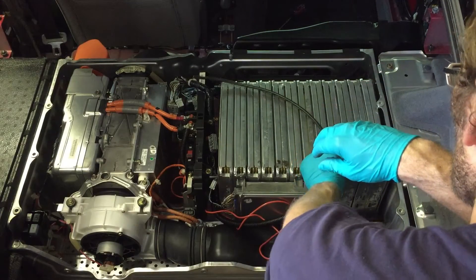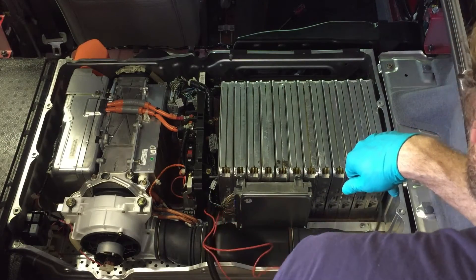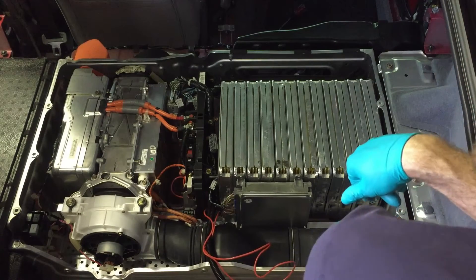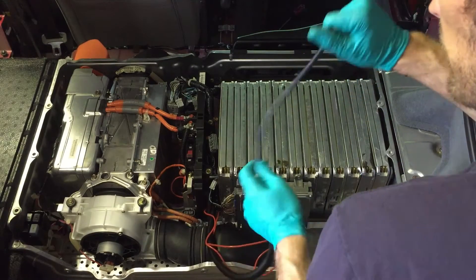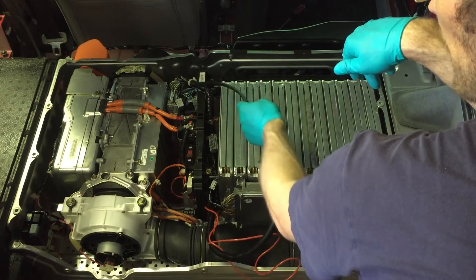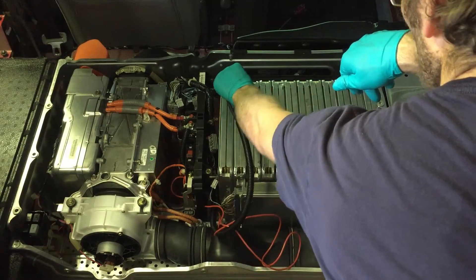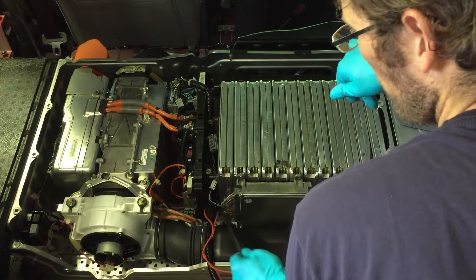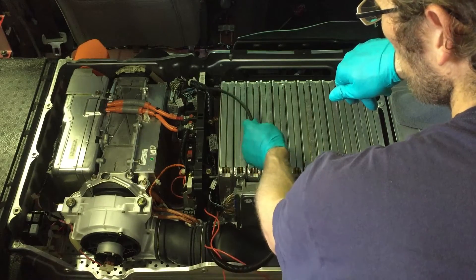You could do the same thing here. You need a smaller diameter cord because you have a narrow height. Once we get a little bracket through there — I simulated the bracket by putting cardboard underneath; the bracket will be eighth inch and I put a quarter inch of cardboard figuring it would collapse 50%. The IMA cable harness, which typically comes over here, now goes through this hole. There's a hole on the bottom already — I didn't cut it, it's there. So it plugs in there and snakes through here where it plugs into the Linsight module.